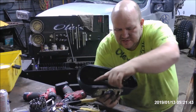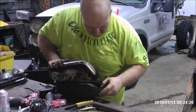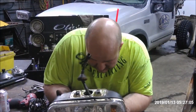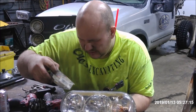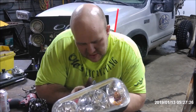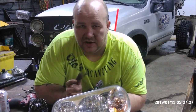There we go, riveted on there. Hopefully these don't stand up too tall — I guess we'll find out when we try and put the light back together. It's in, but it's kind of looking like the two middle rivets here are too tall on the inside. I was initially using three-sixteenths rivets with a quarter-inch shoulder on them and they were barely getting through. So I had some three-sixteenths with a half-inch shoulder on them, but that makes them too tall. It really only matters for these front two, so we're going to pop this back apart, knock those two out, and try and put the shorter ones in there — they should fit a little bit better. Now that the whole plate's compressed down it'll be a lot easier to work with.